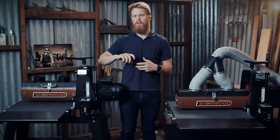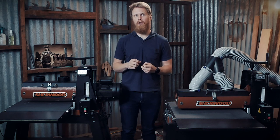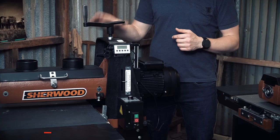If you're trying to take a little bit more off, get it a little bit flatter, or your material is a little bit harder, make sure you wind the feed speed down — just give the machine time to process it properly.